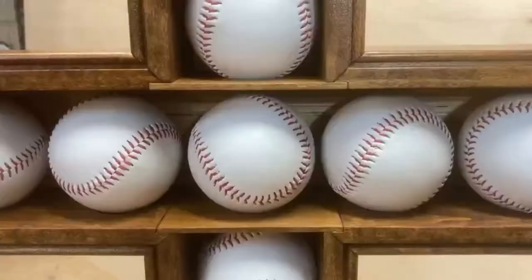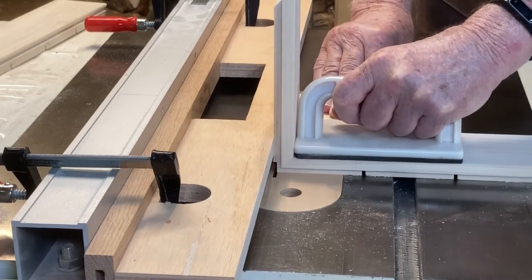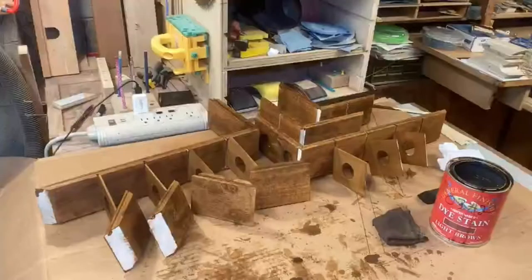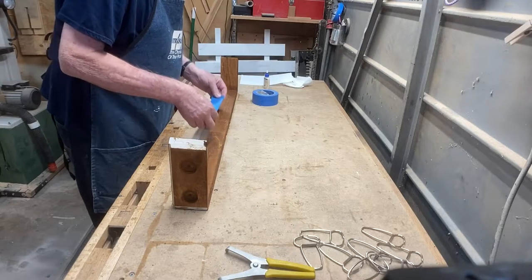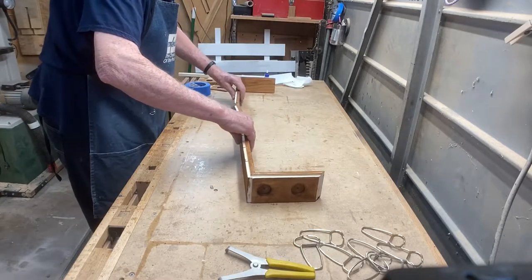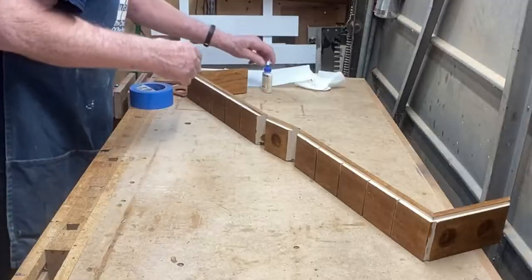Where the two shelves fit in the horizontal section of the cross, to mount them I have to cut a rabbet in the top and the bottom. I applied the stain before I assembled the cross — I like to use General Finishes water-based dye. Now it's time to start some glue-up. I've found that the best way to glue together miters in small projects like this is to use blue painters tape.